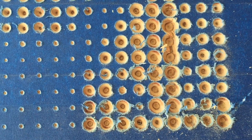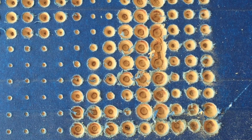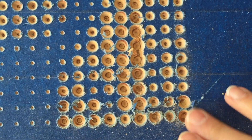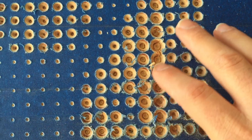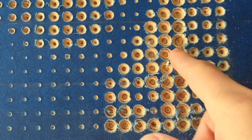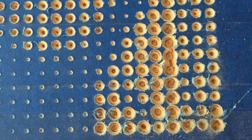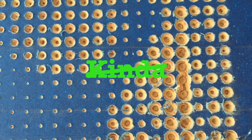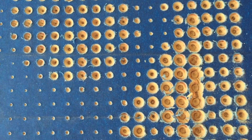I think the cut's too aggressive, so I'm going to go ahead and modify the code and print the second half of this test with a less aggressive feed rate and see if that improves things. I might also check what the depth is supposed to be and make my depth a little less than the maximum, because this tearout's not good. Also, these cuts are supposed to be kind of square, but they still look pretty round to me, so maybe I'll try and modify my code to make them a little more square.